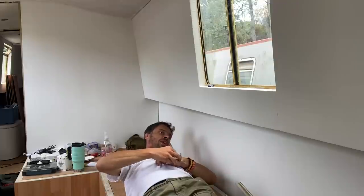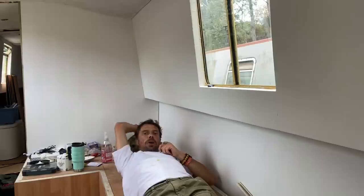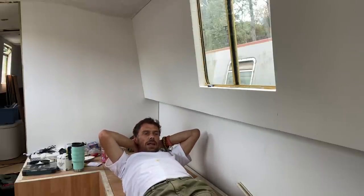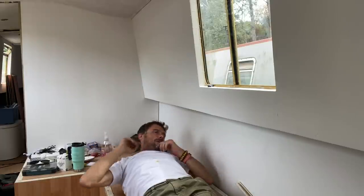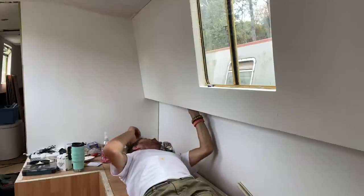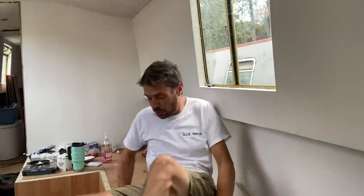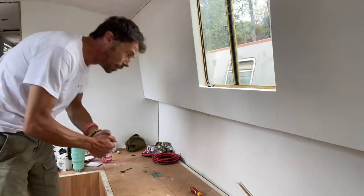And the idea, it's going to be one cable going from the electrics cupboard up to the bathroom. There's going to be a junction box in the bathroom. And then it's going to go from there, basically. It's going to feed the whale gulper, the toilet, and the water pump. So there'll be a sanitation switch, basically, at the electrics point. And it'll turn it all on and off. And then there'll be individual switches for the gulper and the toilet.